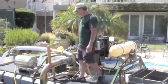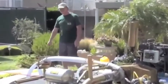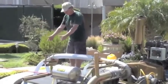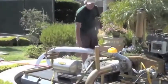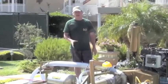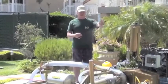Talk about some of the pressure hose plumbing here real quick. We are coming off the pump with a four-inch pressure hose discharge. Over here we have a four-inch by three-inch by three-inch splitter. So we're coming out with two heavy duty pieces of three-inch pressure hose coming down underneath the deck and going into the power jet. We also have what's called a Y splitter, and what this splitter accomplishes is it allows you to pull full pressure and full velocity off the pump. We use this pressure hose for a variety of different applications — specifically to power a smaller two and a half to three inch suction nozzle that I'll show you in a few minutes.